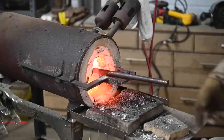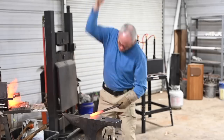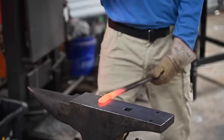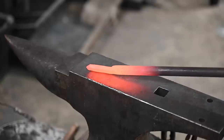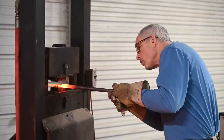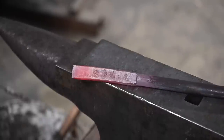Just for a demonstration, I've heated up a piece of three-quarter inch bar in my forge. I'm going to whale away on it as hard as I can and see what happens. Oh man, I do this for a living and I'm tired already. Now let's stick a piece of it — just the same size, same heat — into the forge press. Wow, big difference. And more to the point, my elbow isn't killing me when I'm done.